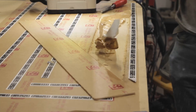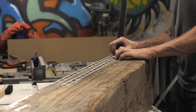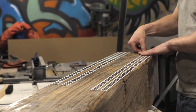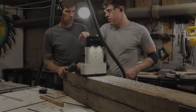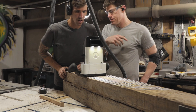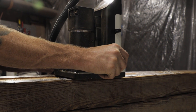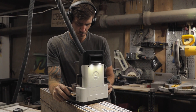I should mention you could also cut the acrylic and create the cutout in the beam with standard woodworking tools like a router and a circular saw, so you don't really need the Origin. But using the Origin did make it easier to get an exact pressure fit — we just used the same pattern on the beam and offset it by a hundredth of an inch so the acrylic would pressure fit nicely into the rabbet.